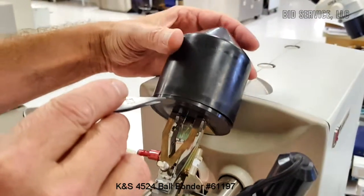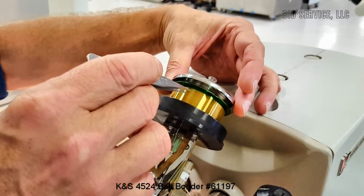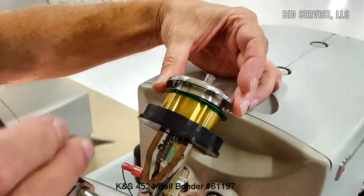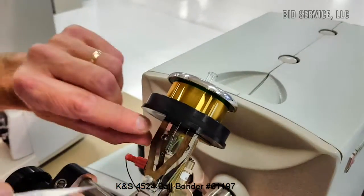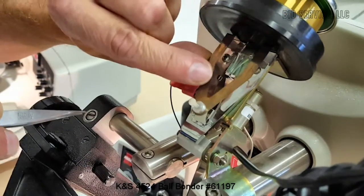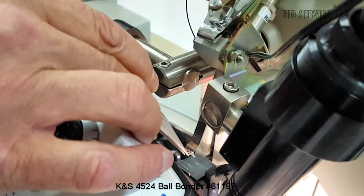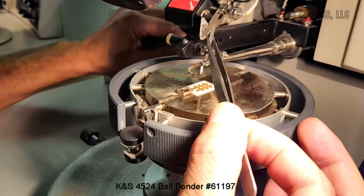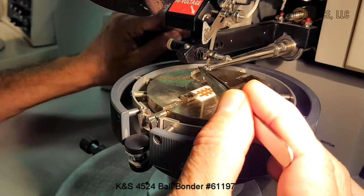The wire gets loaded in here — we have this cap covering our spool of wire. It's a two-inch spool of gold wire. There's a cap on here and we have a glass feed tube. You place the spool in here with the cap and feed tube, and feed the wire down through that tube. It comes down along this plate and there's a little glass slide here — the wire is underneath the slide, which is a tensioner to put a little tension on the wire. It gets fed through this eyelet here, then down through your drag clamp. As you open your clamp using the clamp switch, you'll see that both the drag clamp and your clamp open up so the wire comes down through the clamps and down through the capillary.